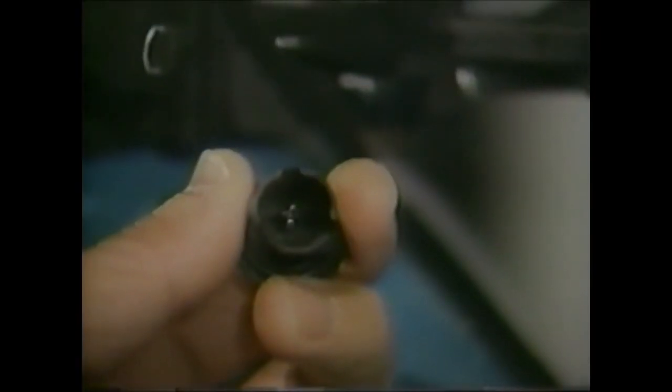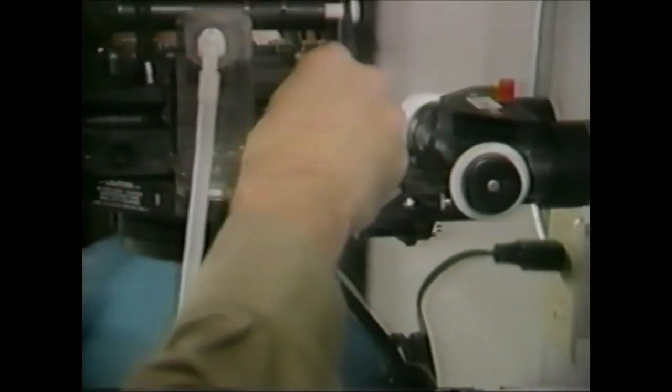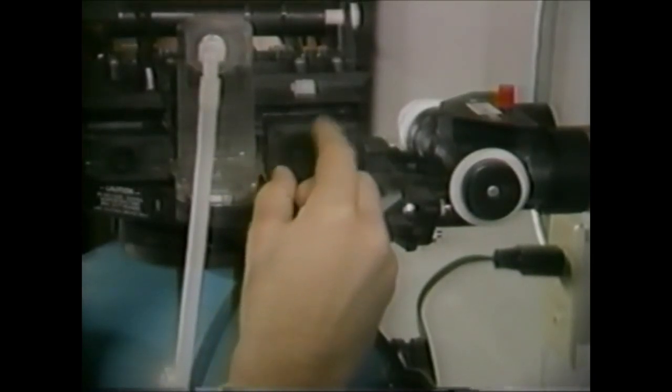The number of grooves molded in the conical area control the flow rate during backwash, and the rubber ball acts as a pressure regulator. You will get an accurate backwash rate at various inlet pressures.